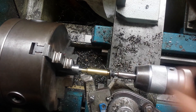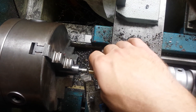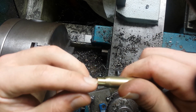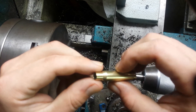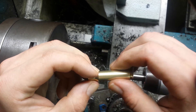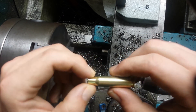The reason why I started this — now you just need to reverse your tailstock, and now you have a perfectly uniformly neck-turned case, which is ready for re-neck sizing on my Lee Collet neck sizing die, and then it will be ready for loading.